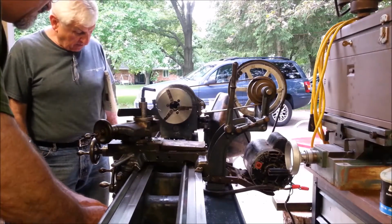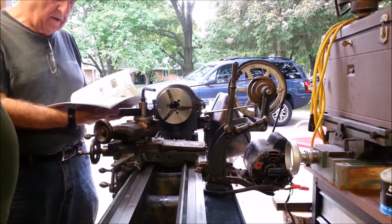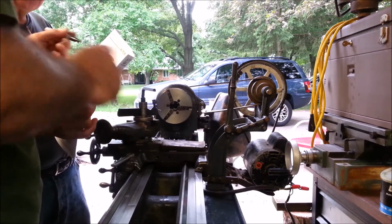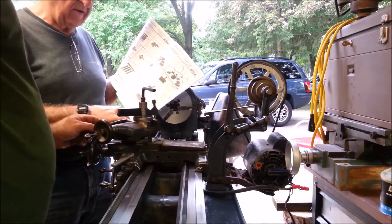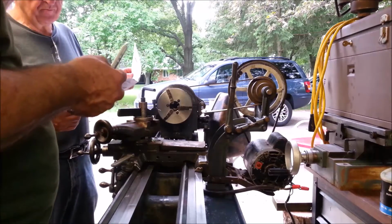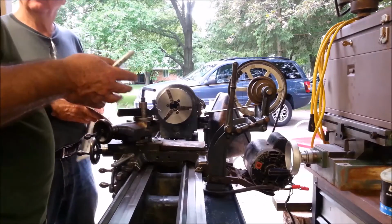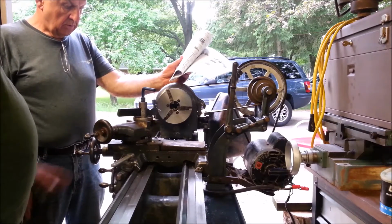What do you think? Yeah, I think I'm interested in it, sir. Okay. One thing you mentioned, if I ordered this one, the one that I needed to order, which one was? Oh, let me circle it. It's the AXA. The B, you might not be able to get the tool down to the center of the work. And will that need any machining then in order to fit in here? He'll send you a block that'll be way too big for this. And there's a guy on eBay. Just go look for tool post mount, something like that, and you'll see he's got them listed for everybody. This is a 10-inch, so if you just buy one for a 10-inch Logan, he probably says Logan Wards. If you buy one for a 10-inch Logan, it'll go right in there. And it'll save you a whole lot of headaches.